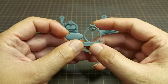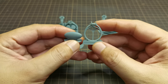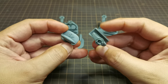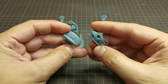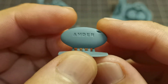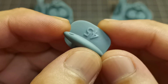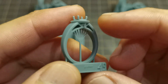Since antialiasing on all surfaces facing the X axis is not working properly, I suggest minimizing the surface area facing the X axis. Orient your object 45 degrees on the Z axis to minimize the X-axis surface area. The print result on this ember model I always use to test antialiasing shows the surface is smooth with no voxels. The ring model is also the same — smooth and no voxels at all.